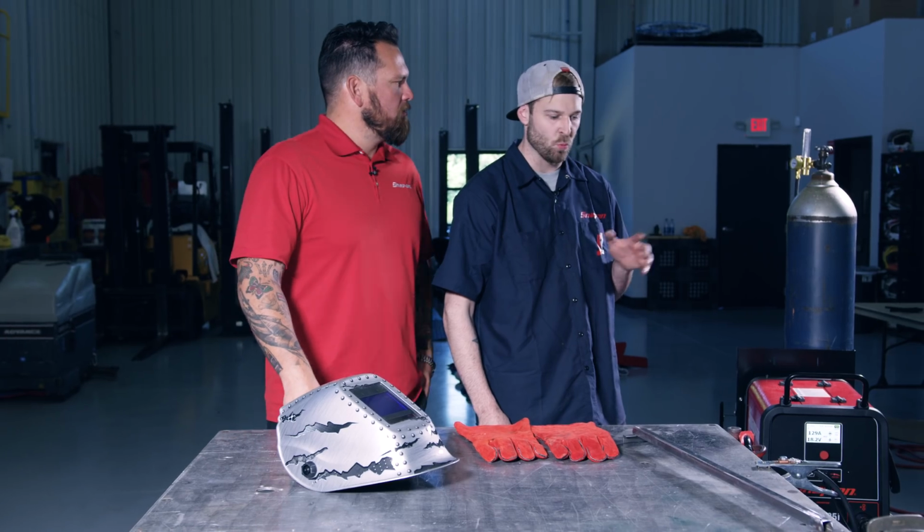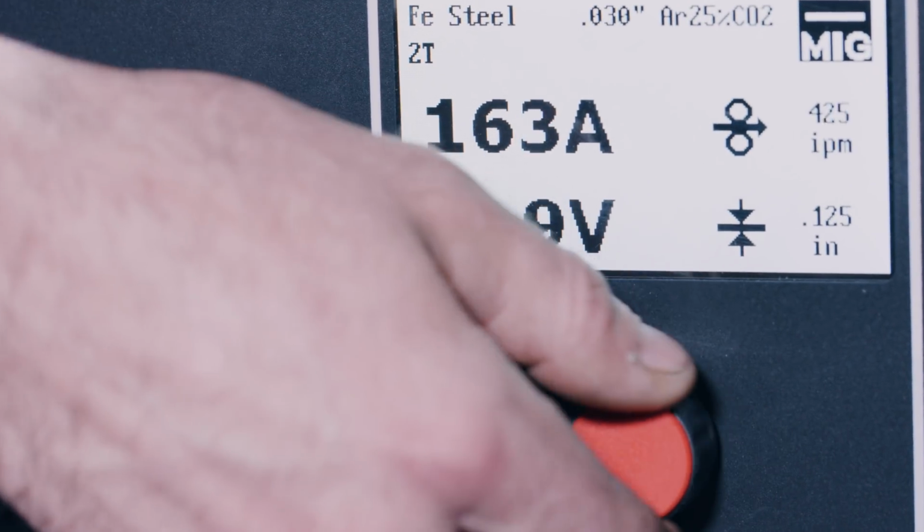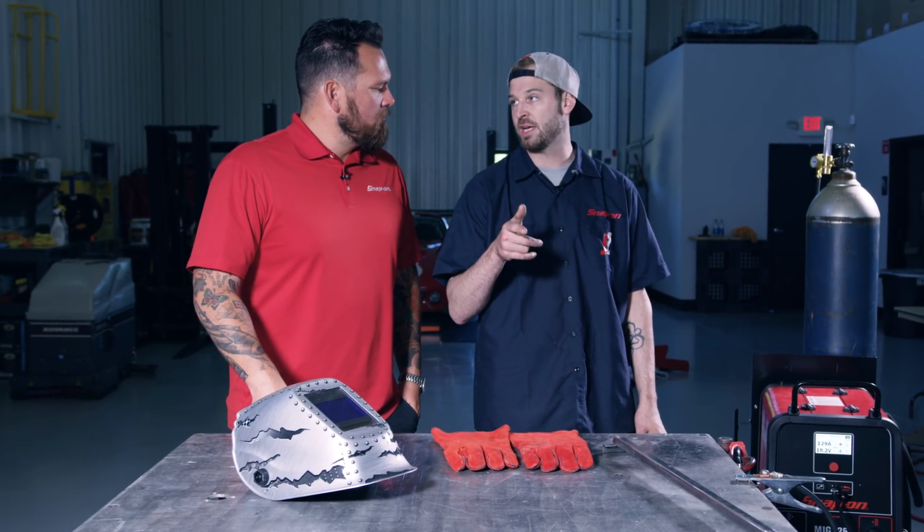This is nice because the wide amperage range adjustment goes up to 200 amps, so you can burn into some pretty thick metal. Doing some thinner stuff right here at the table, and then some of the bracketry for this will get welded onto the chassis itself, which is 1/8 inch and then 3/16 inch steel on the chassis. So you need some good amperage to be able to really burn into it.